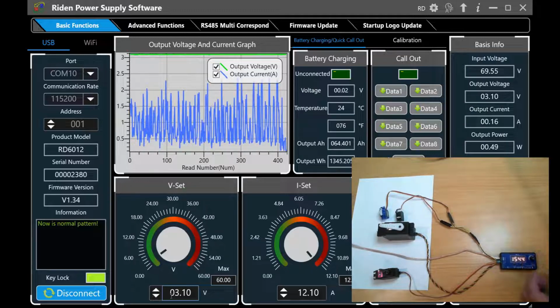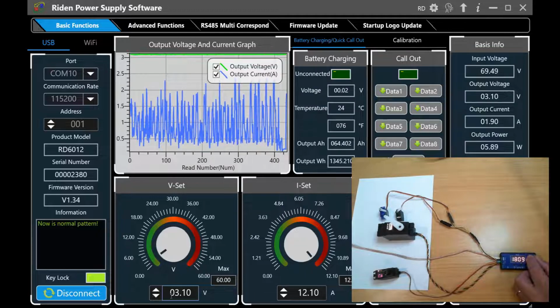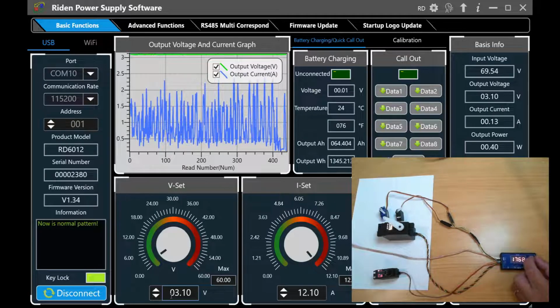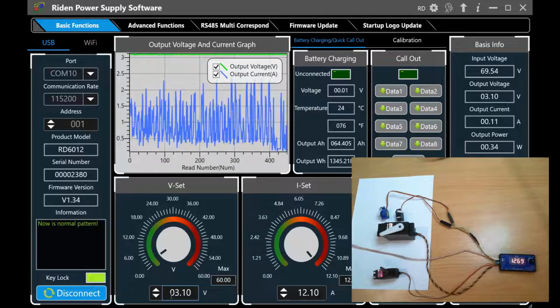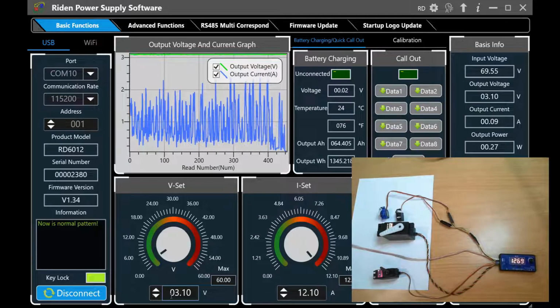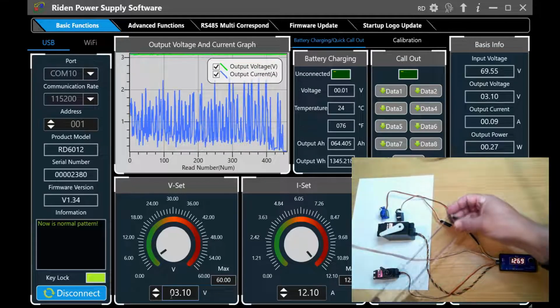So while they're stationary, there's a little bit of movement on the HiTEC, but not much. And you can see their power draw has now dropped right down. But as soon as I start to move them, they start playing up. And the reason they start playing up is the current draw through the wire is enough to create issues. So let's just extend our wiring a bit further on these. So this is an extension.